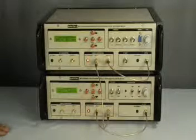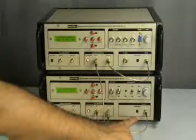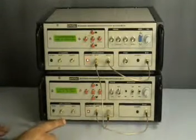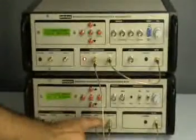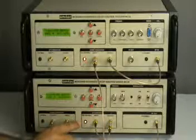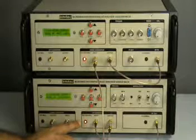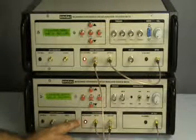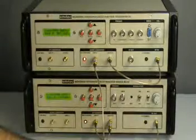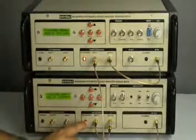The source has a frequency of 87 to 898 MHz available at the SMA connector in that block. The frequencies from 899 to 2000 MHz are available at the output SMA connector when the up converter mode is enabled, being displayed by a glowing LED. While a frequency from 899 to 2000 MHz has to be outputted, the RF output connector has to be connected using a SMA cable to the up converter input.